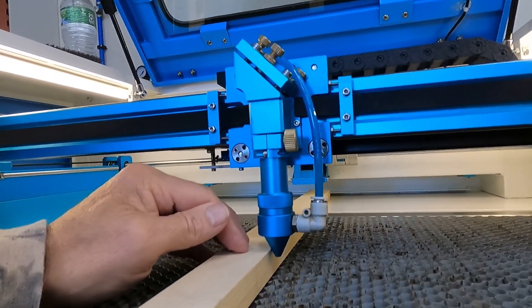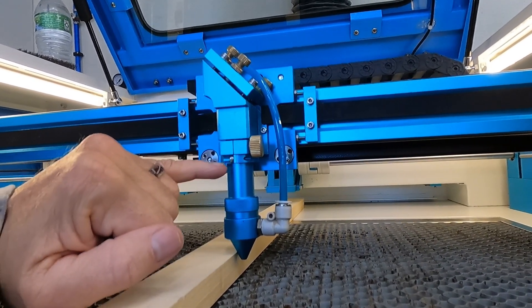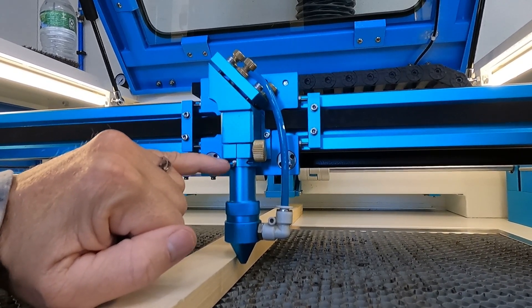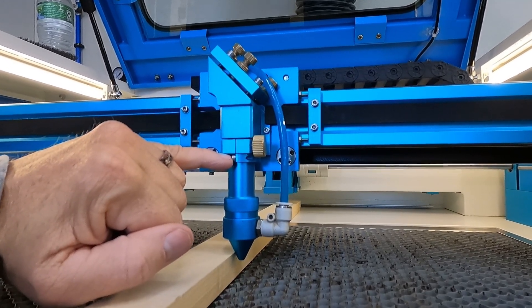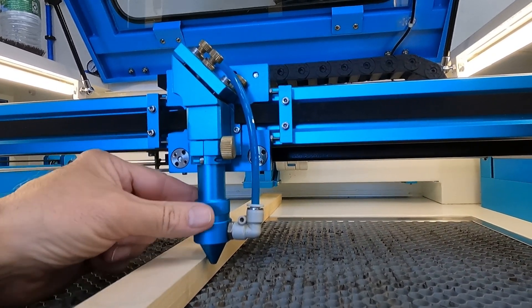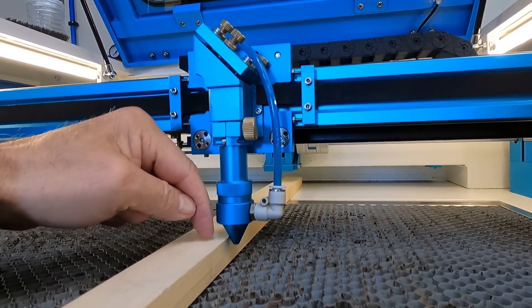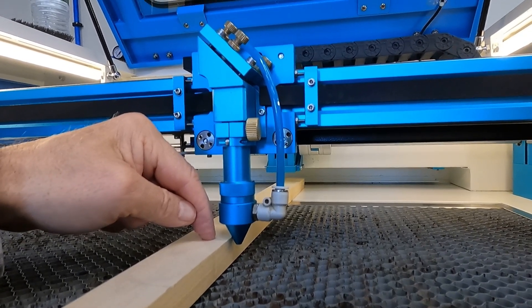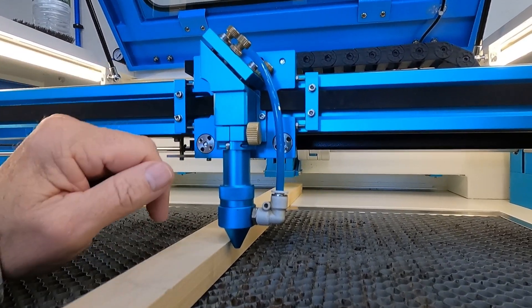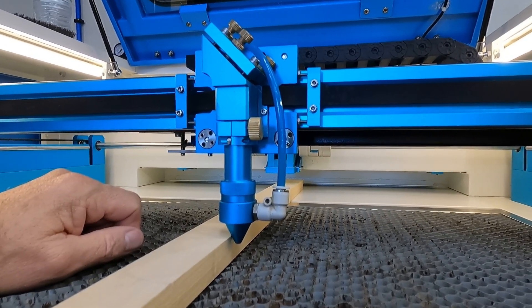So what we're going to do — this is set from the factory to use the autofocus — we're going to take this little screw right here. This is the focus ring that's set when you're using your autofocus, and we're going to loosen the screw right here. We're going to get it so this ring drops down, and that gives us the ability to raise up this nozzle far enough where we've got plenty of clearance and we can focus on this three-quarter inch piece of wood. Once we do that, we can do our work and then I'll show you how to refocus it so it's back to the way it was before, so you can continue to use your autofocus.